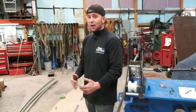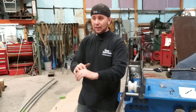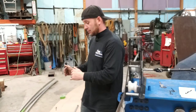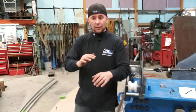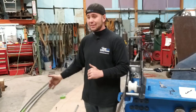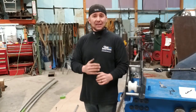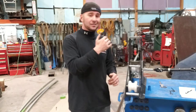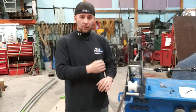So what we do now, the first one took the longest. The first one we had to put it in, crank it down, roll it, take it out, check it. All right, need a little bit more. Put it in, crank it down, roll it, take it out, check it. So we did that, took a little bit longer than the rest, but that gave us our baseline of where we were rolling at. Because every time we rolled it, we wrote down the measurements as to where we were.